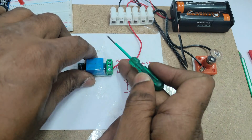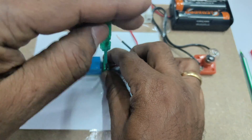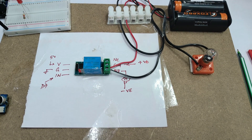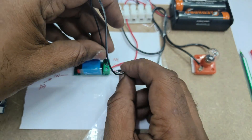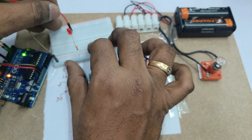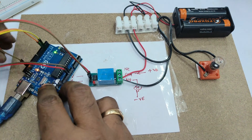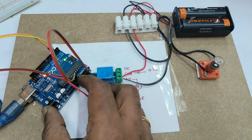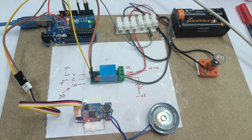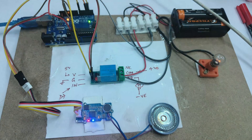Connect the common pin to the positive supply. One wire of the bulb is connected to NO and the other wire goes directly to negative. We are using a 7.4 V supply as the bulb load is rated 6 to 9 volts. When a trigger is applied from D7 to the IN pin, the relay turns on. With the ground common and the relay wired up, say 'Hisel, turn on the light' — the relay energizes and the bulb lights up. Say 'Hisel, turn off the light' and it switches off. Thank you for watching.